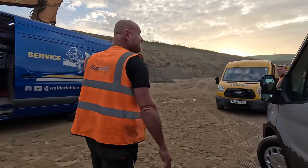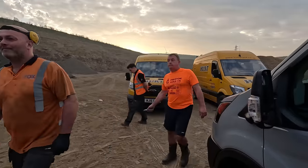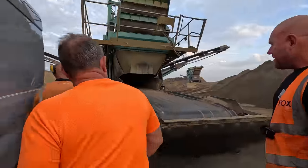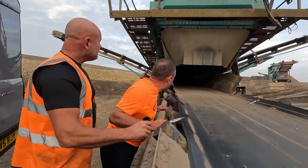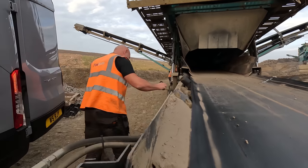Bob, you just explain to us what we're doing with this belt today. We're going to vulk it, yeah? So we'll cut it off, pull it off. Yep. Feed a rope round. Do you want a rope round so you can change the skirts? Yep. And then we'll winch the belt back on with the rope and then vulcanise it underneath, hopefully if it tensions off. Yeah.